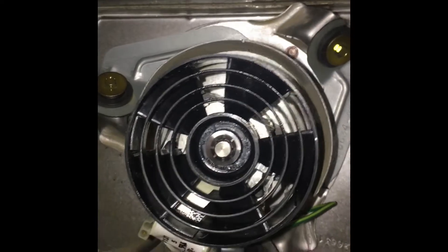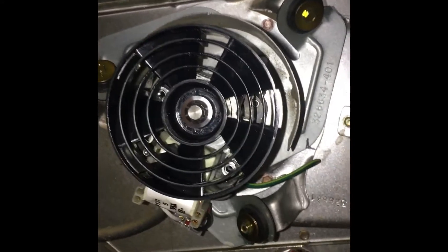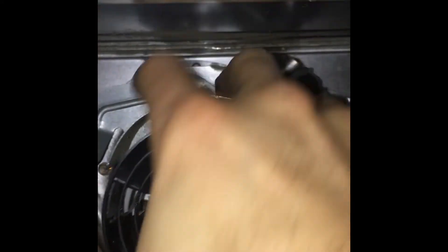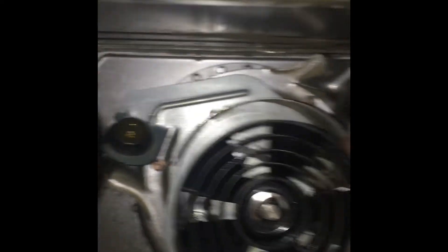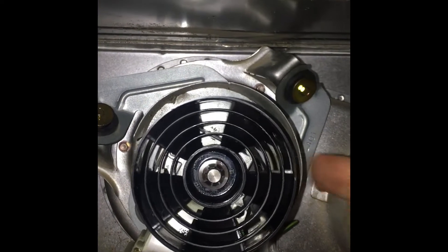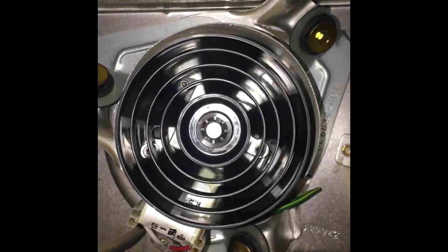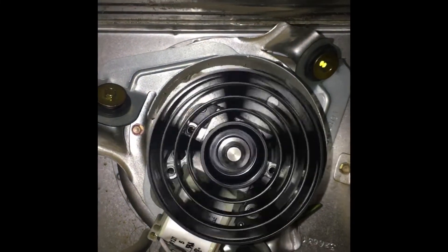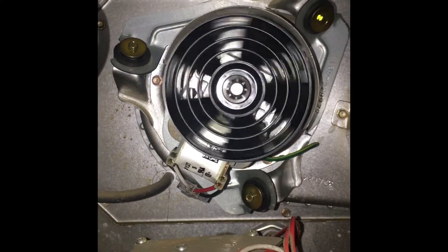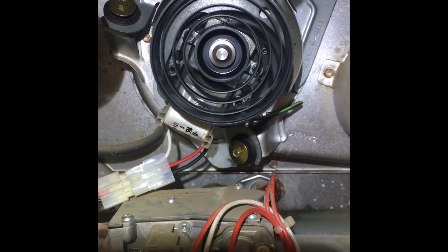She is back installed. All I've got left is hook up the electrical. I sat this in here after replacing the fiberglass gasket, leveled everything out, and made sure it was spinning freely. She runs a lot smoother than the last one. The top fan is still a little warped like the last one — I don't know if that's just part of the manufacturing — but either way it spins a lot better. We're going to hook her back up and start her up. Voila! She's working and there's not that large whining howl. We're going to let this heat back up and see if it doesn't make noise under load.